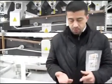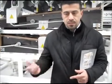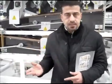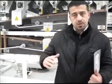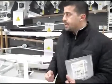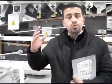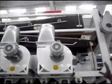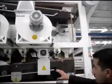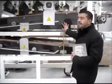It could be grain, oil seeds, or garden seeds. What we will talk about today will be wheat. Wheat is the most popular seed all around the world, so you can apply this principle to your own seed also. Now, the machine is constructed from two sections. We call it the pre-cleaning section, which is the two top screen boards, and at the bottom there is an aspiration room as well as two screens for fine cleaning.